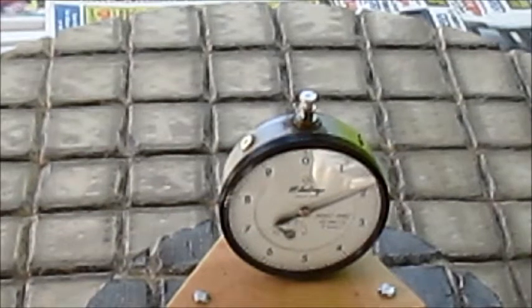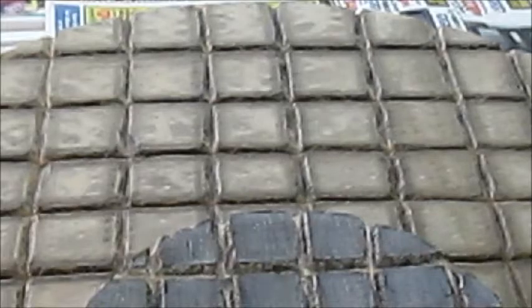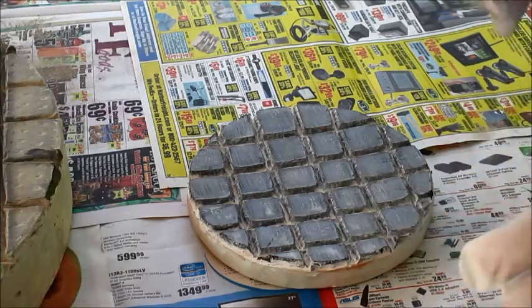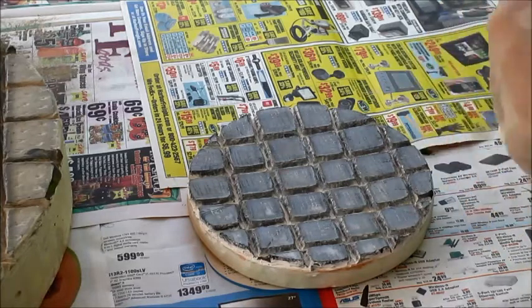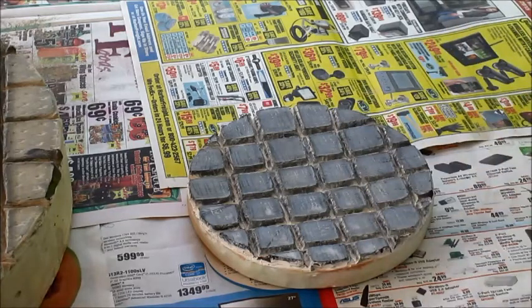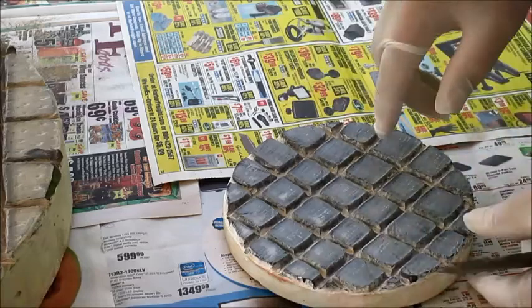Especially for the temperature I'm working at in my basement, so I'm going to strip these laps. You want to do it outside because this is a really messy job. It's a good idea to have rubber gloves too, because pitch powder will just get everywhere. I once got a piece of pitch stuck up under my watch and it caused a pretty good burn, so you want to be careful working around pitch.